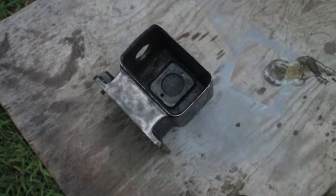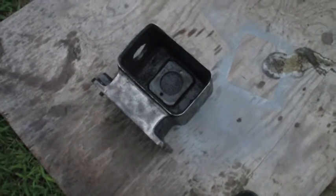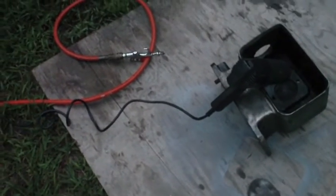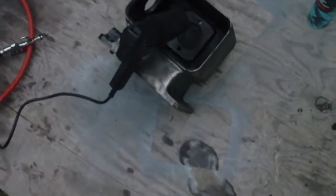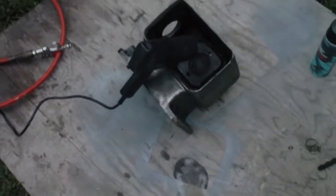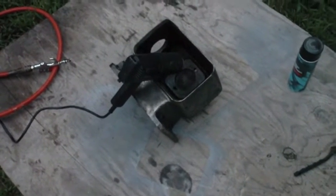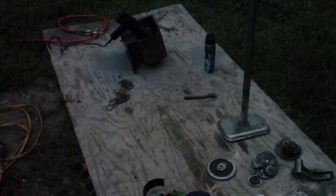The problem is now it's damp, and if I leave it out here it'll probably give me flash rust problems. I thought about using the propane torch to heat it up and drive some of that moisture out of the porous castings, but instead I used compressed air to get the heavy stuff out, and now I'm just using my heat gun — I'll come back in a little while and see if it's burst into flames. When I walked back over I could smell the heat coming off — whatever it's burning off. It stinks.